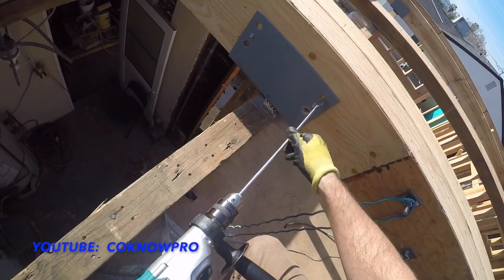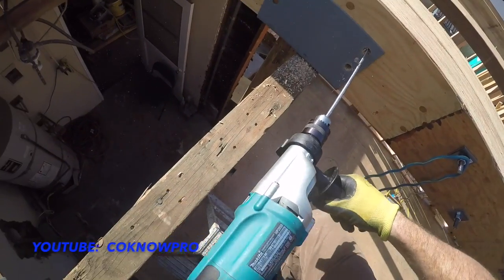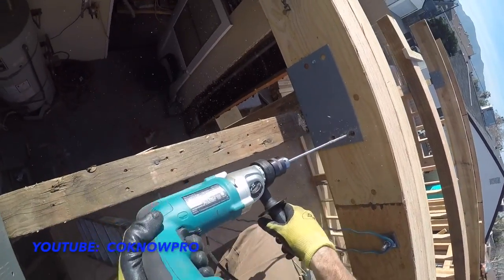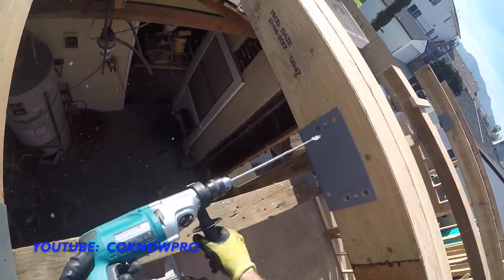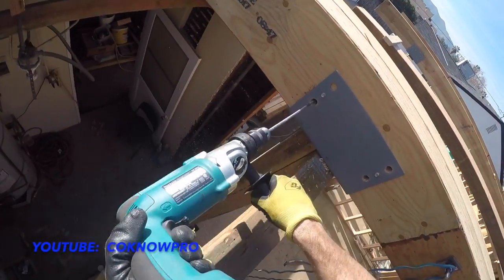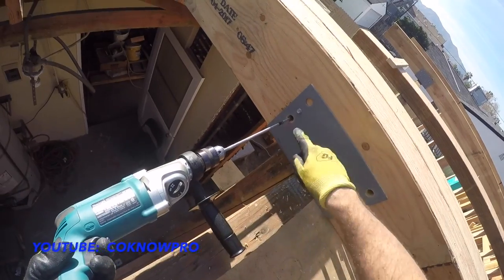Now when I'm grabbing this rod right here, I got my finger off the trigger. Push in, forward. Reverse. Great, back in. Nice. Right. Boom. Now if you notice, right when I slip into the other hole, right when it makes that connection, because they're not going to be completely lined up 100%, it wants to catch and bind on you. So be ready for that when you know you're getting close to your guide here.